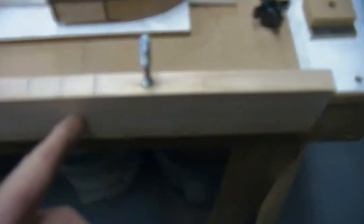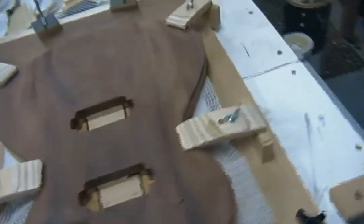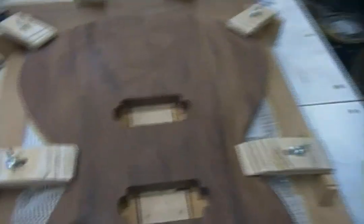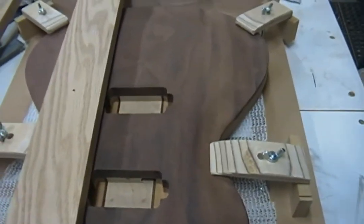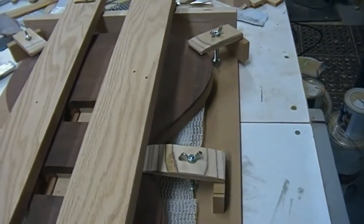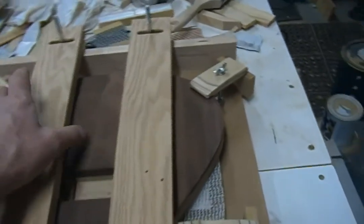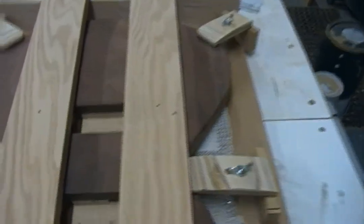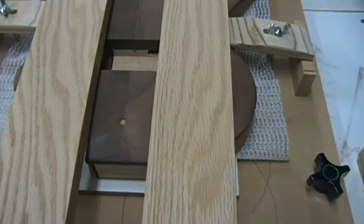The first and most critical thing is that there are good center lines on the jig and that they go all the way through so that when you set up, everything gets centered well. My straight edge clamps to this edge so it can't move on center, and then I get the back edge on center. The guitar gets centered up in the jig and gets clamped down well, then these guys go on. I just ran these through my jointer to straighten up the edges and faces - ran all four sides, two sides and two faces. Those get adjusted for the neck, then the router will just run along - I'll put a stop here where I want it. You can see I have holes where I mounted a stop before for the router neck pocket. Once that's all set up, I'll route that out.